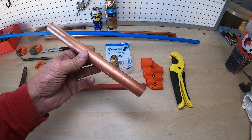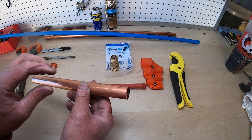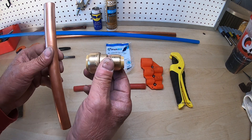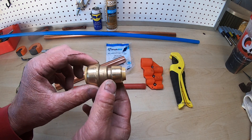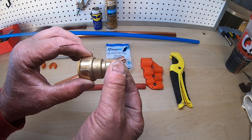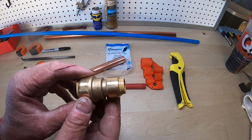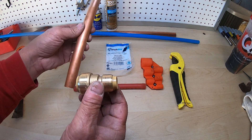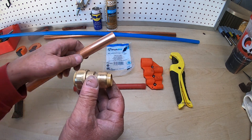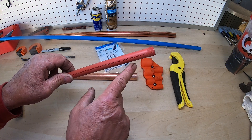Since I'm using three-quarter inch copper from my tankless water heater and then connecting it to PEX, I figured I would show you how I go about doing that. I'm coming out of the bottom of the hot water heater with three-quarter inch copper. It makes a 90 degree and then I'm using what they call a SharkBite fitting. This particular fitting will allow me to connect copper on one side and PEX on the other side, or copper on both sides, or PEX on both sides. I'm going with three-quarter inch copper for my supply line going into the hot water heater, and then coming out I'm going back to PEX — blue PEX for supply and red PEX coming out of the hot water heater.